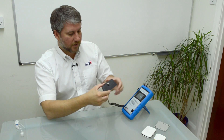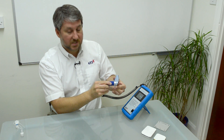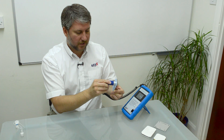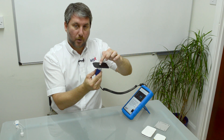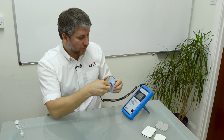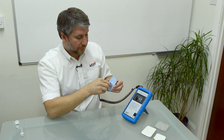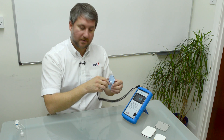As you move this around the outside of the mould, when you get to the position where you want to measure the thickness, just draw a small figure of 8 on the outside of the mould. That will ensure that the ball bearing is in the centre of the sensor head. You can then read off the measurement from your sensor — in this case, we're getting about 3.9 to 4.1 millimetres thick.